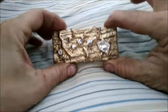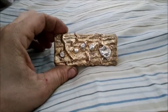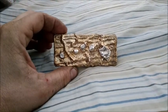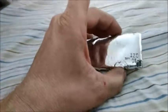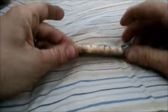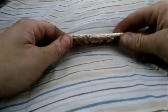I did get some tarnishing solution, kind of like liver of sulfur. So tried that out and worked pretty well. And had a nice patina here on this side. However, who wanted this wanted that off, so I went ahead and polished that all off, nice and shiny again.